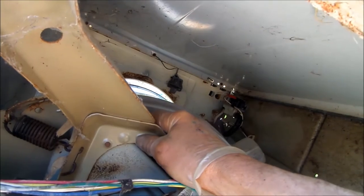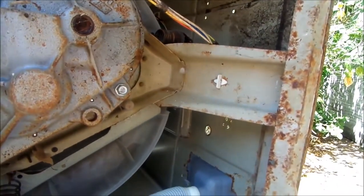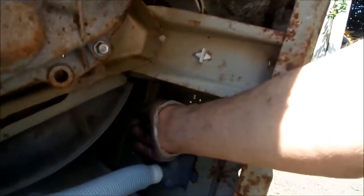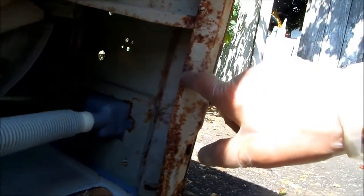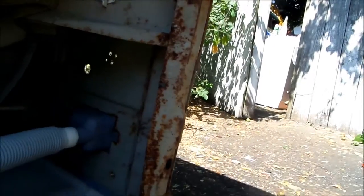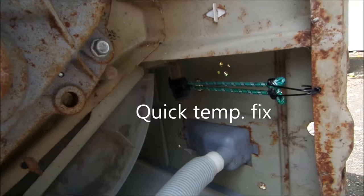If we look back here at the springs, we have the three springs that are intact, and we have the base slide mounts — three of these: one here under this piece of metal, one there, and one there. But we do not see the balancing spring here. There should be a spring going from here to here. This is what happens on these older machines typically — it will rust through here and then fall off and the spring gets swept under the rug.